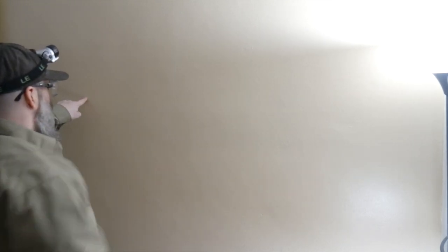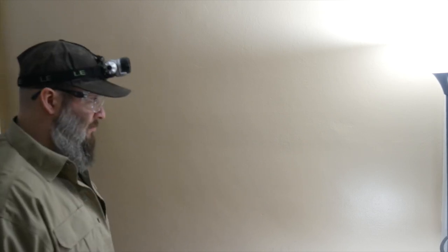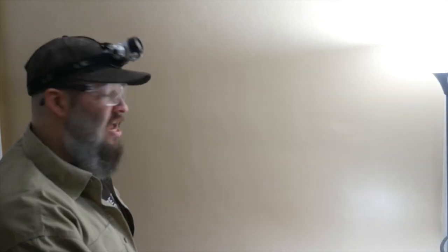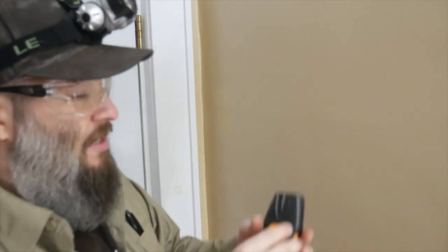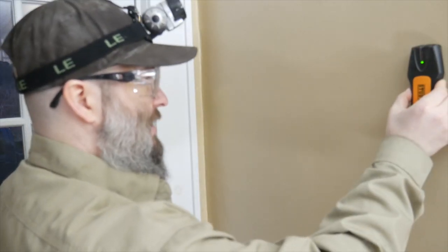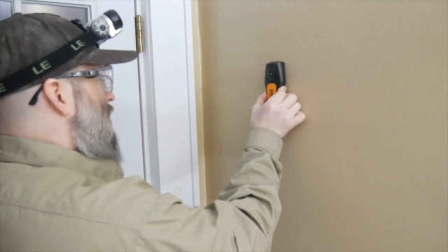I don't know. Do you know? Is it there, or is it over here? What we do know is that there is a stud in the corner, and if we measure 16 inches off of there, there should be a stud right there. Now, how do we know? You can put a hole in the wall — probably not the best thing to do — or you can get one of these stud finders. The way these stud finders work, they send frequencies and test the depth. You put it against the wall, push the button and hold — it will beep, then disappear. Then you slide it along the wall without moving it away from the wall. And if you come to a stud, your beeper will go off. According to this stud finder, there's a stud right here.